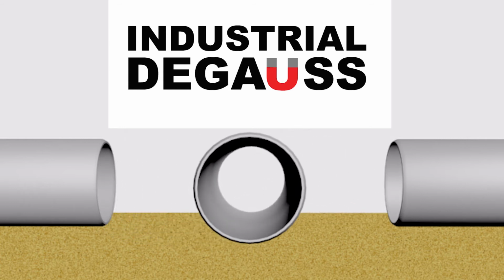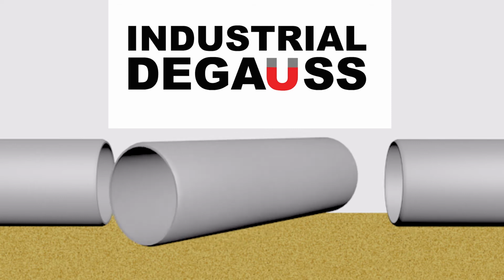Measure the Gauss at 12, 3, 6, and 9 o'clock. We start to degauss with the highest reading. You will have higher readings with fitted up pipe and beveled pipe versus pipe that's on the rack.